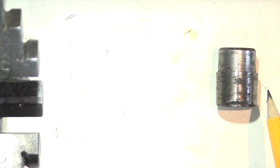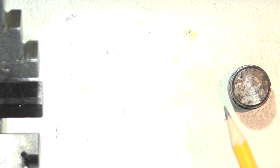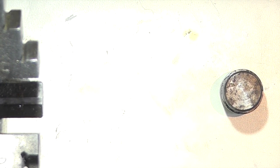That's the part off the bottom of the vice. It's two diameters: the big diameter is 20 millimeters, the small diameter is 18. The 18 needs to be a press fit, the 20 needs to be a couple of thou, three thou under the hole size. Now I'm not sure whether this is small or whether it's the hole that's big, so I'll just measure that to see.